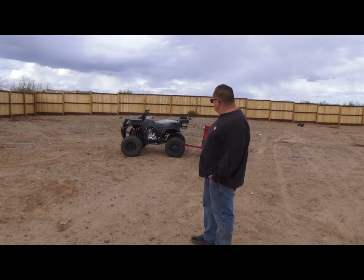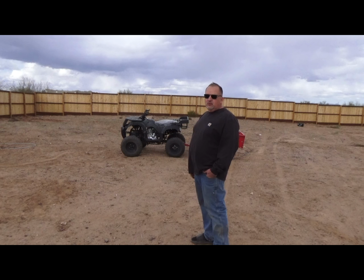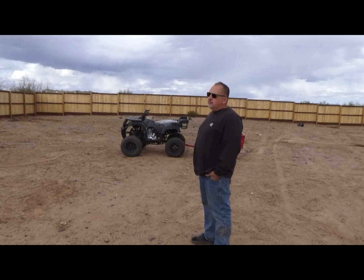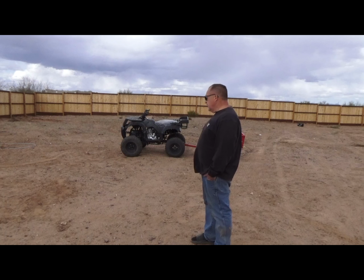So I think for the next time I come home, we're gonna take the plunge and go back to the 530 chain that was on there, and go ahead and go to Wygo stock and pick up the custom 41 tooth 530 chain for the rear sprocket. It's a lot bigger. And of course, $33, that's like going to be $80. $33 for the front sprocket and whatever else for the retainer and the chain.